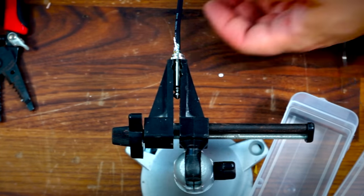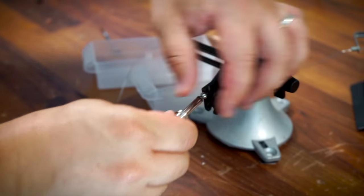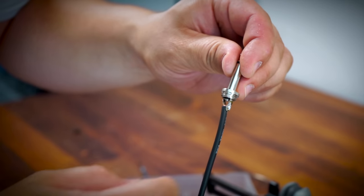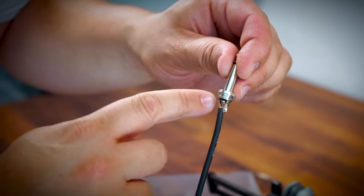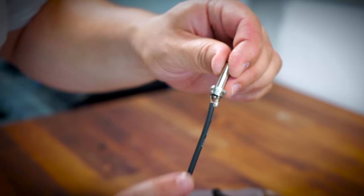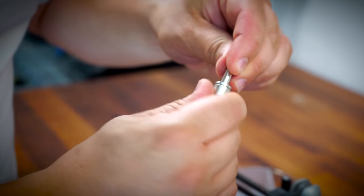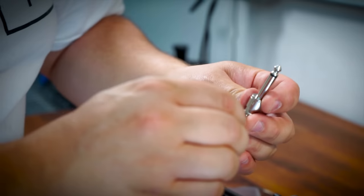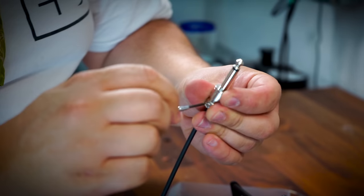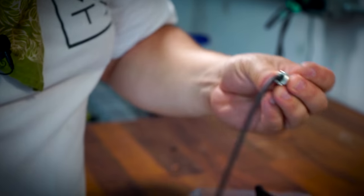Now you can see there's a little bit sticking off — I'm going to take my wire snips and cut that flush. We now have a perfectly soldered cable. You can see the clear separation: the shield is tied to the sleeve, and the tip and the center conductor are together. They're not touching at all. There's no stress on the cable. And this exposes as much of the outer diameter of the cable — the rubberized, plastic part — so that when I screw it together, I'm not screwing into raw cable. I'm screwing into the outer diameter, holding it nice and taut, restricting any pulling and any lateral movement.